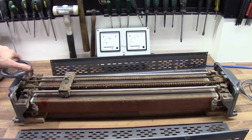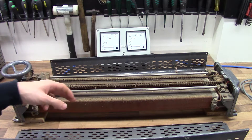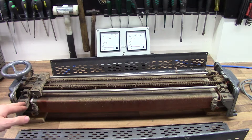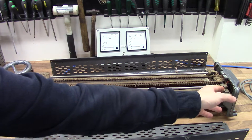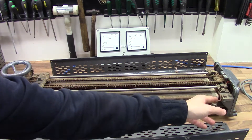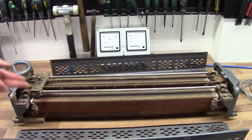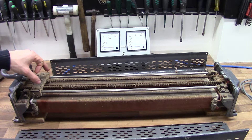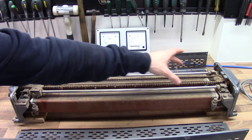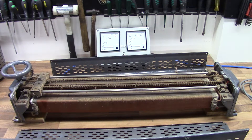Inside we've got two cores — these are linear cores, so there are two of them rated at 7.5 amps each. This side is 0, this is the negative, and it's rated for 240–250 volts. The power comes in this side and livens the two cores up in parallel. Then there's a neutral, and the wires from the neutral point go underneath and back up to the power in. The brushes conduct back through the two bars on the top — that's the brush contact — going back to this side into a brush terminal.